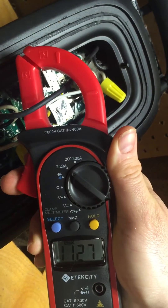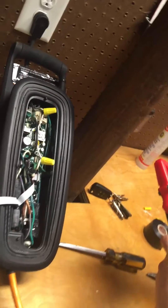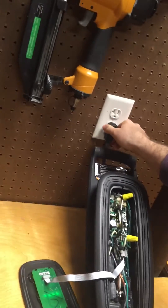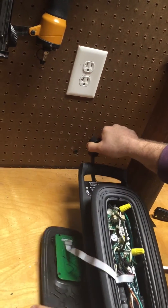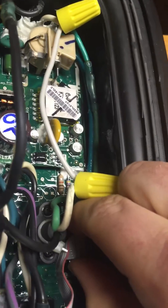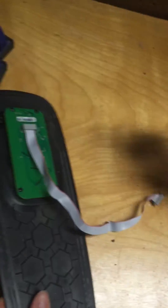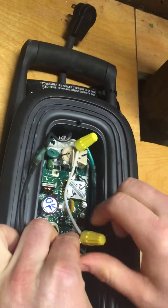So just use a 20-amp fuse, which is kind of in line with what I read online. I'm going to take that off and start to replace the fuse. The charger is plugged into the car — I'll just unplug it from here because it's easier, and I'll remove this little ribbon connector right here just to give myself some space to work. The car is not going to like that I unplugged it — it'll start beeping — so I'm going to take off the jumper.